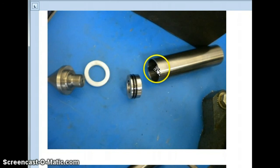Inside the bottom of the sleeve, there's a retaining ring with two O-rings, and we do recommend changing that with every second or third sleeve change. They tend to get a little out of round after hundreds of pushings. And if you have any trouble with the sleeve operation, always try a new sleeve and a new retaining ring before just assuming the cone itself is bad.